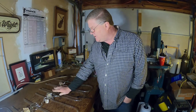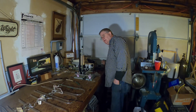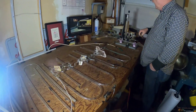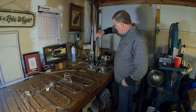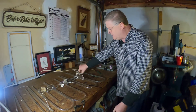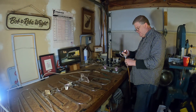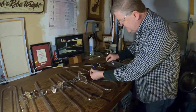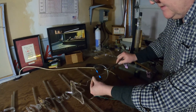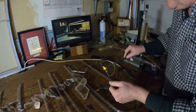The unit's cooled down to room temperature. The reason we do that is so that when we fill the gas, our pressure's correct. We're going to do a quick test. The fact that it didn't flash in means we've got a clean tube. Turn off the vacuum, engage our little meter, do a quick test — we're ready to take it off. And again, because it's under a vacuum, all we have to do is heat it and it will pinch itself off. And we're ready to go to burn-in.